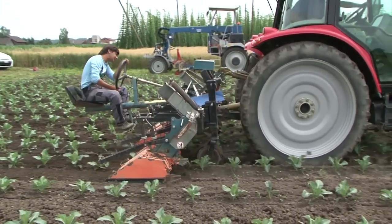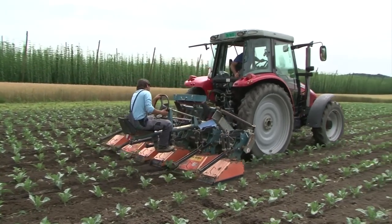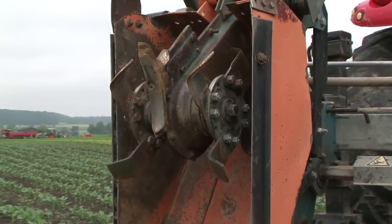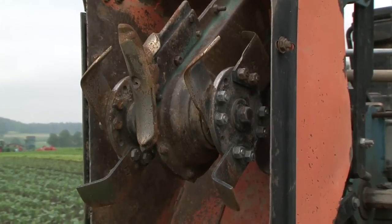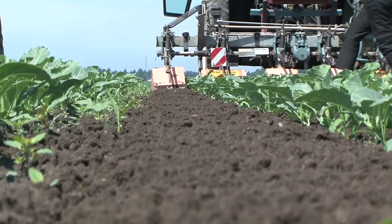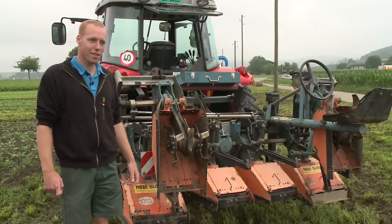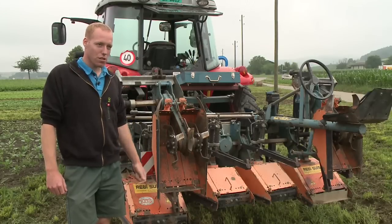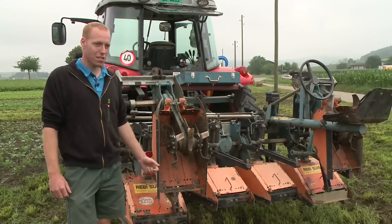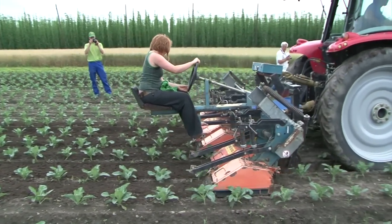There is a wide variety of multi-row rototillers, mainly used for crops that need longer growing seasons. This model is designed for cabbage. With high weed pressure or crusty soils after heavy rainfall, the rotors with blades can loosen the soil to a depth of 10 cm, obtaining fine soil suitable for additional cultivation with, for example, the finger weeder, while simultaneously chopping up weeds. However, if the crop is too big, driving down the rows risks tearing leaves off plants. Large stones can jam the blades, and weeds that propagate from roots pose an additional hazard, as each cut piece can give rise to a new weed and the machine may spread them to other crops.